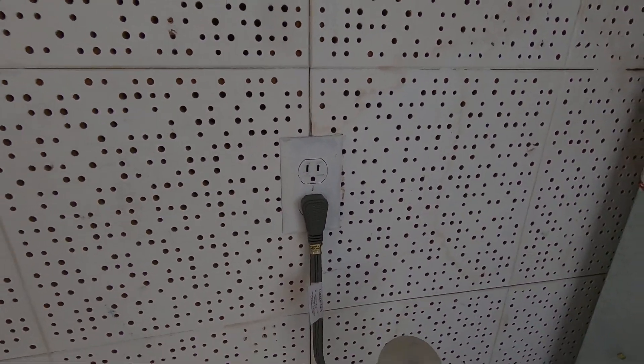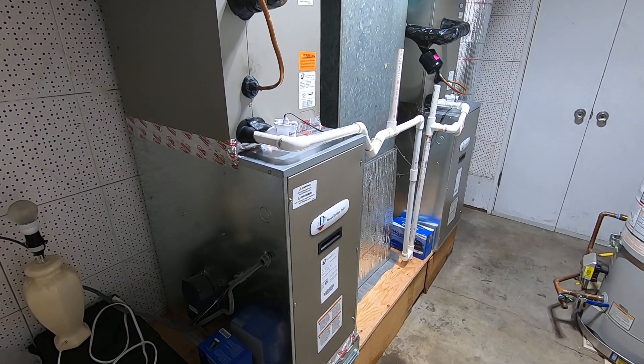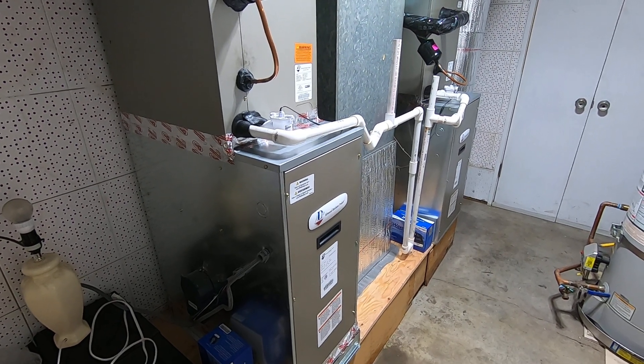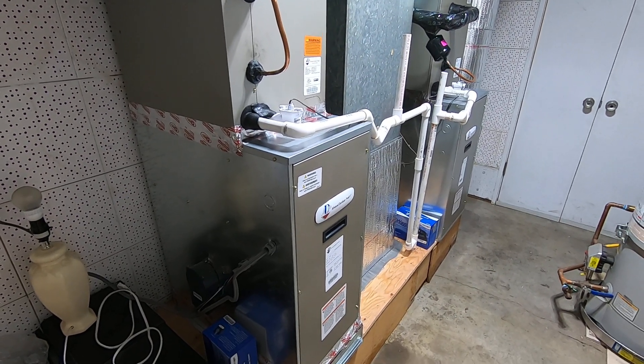The reason we did these is they plug into the wall — into the same outlet that the furnace plugged into. They are 115-volt, meaning you do not need to run a dedicated 220 circuit from the panel to each of these fan coils. Many fan coils on the market today are 220-volt, though more 115-volt options are coming out, which is very nice.